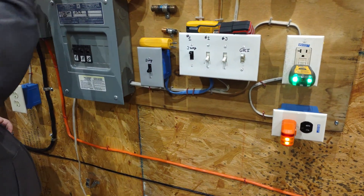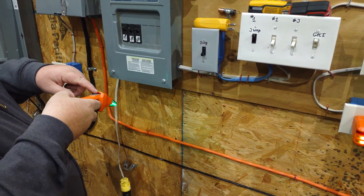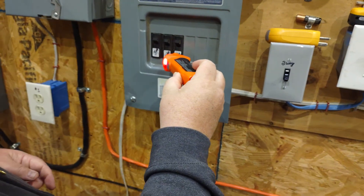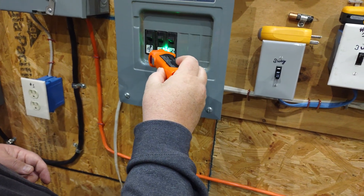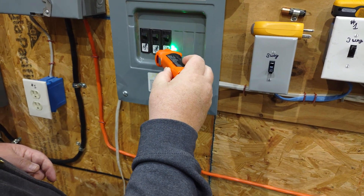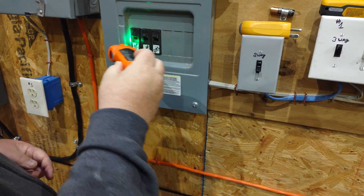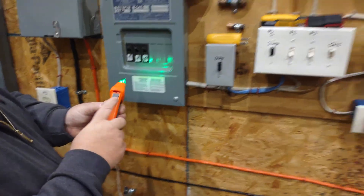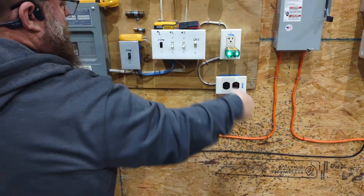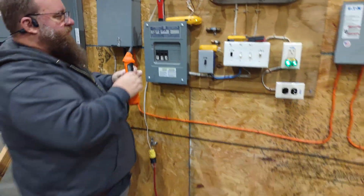This Milwaukee is probably the slimmest, which is kind of nice. I like the fact that it shows red as you run across — as you get close it gets brighter and louder and louder until it's going full blast right on the breaker, then back to green as you pass over to the next circuits. These tend to really do well — just keep passing by until you find it. Hit the button and hold it down to reset. Another nice feature on both the Milwaukee and Klein is that you can store them together in your truck — both the receiver and sending unit snap together.